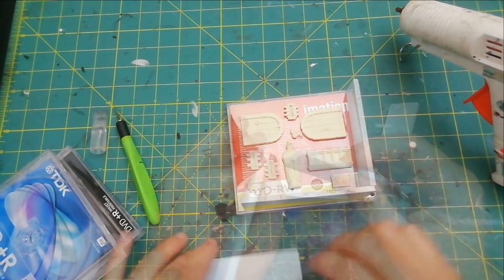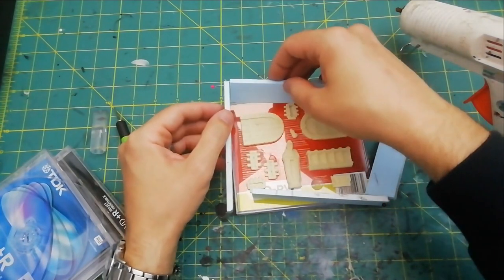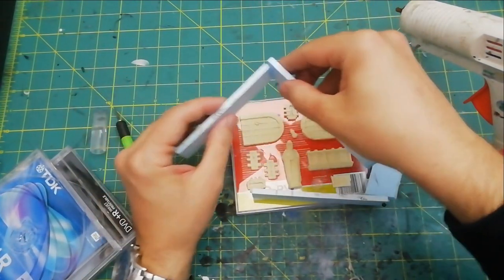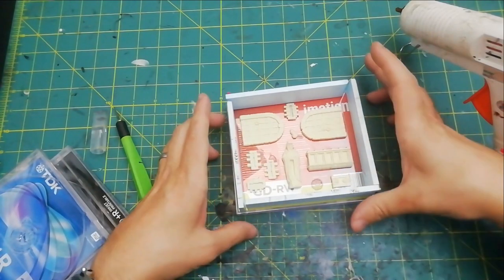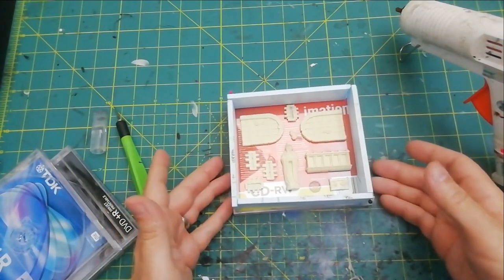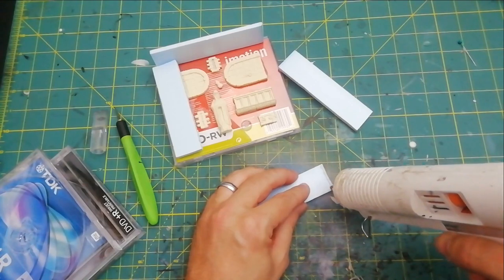At first I gave it little importance, but then I realized that following some fundamental rules significantly increases the quality of the final result. First of all, it is necessary to group the pieces according to very important characteristics, namely their height or thickness. Having extremely flat pieces together with others much thicker, or that will require a greater volume of silicone to be immersed, will result in a great waste of material. So try to insert pieces that are similar in thickness into the same mold.